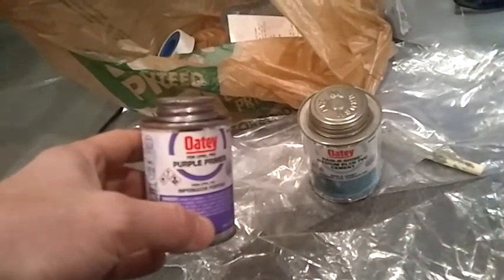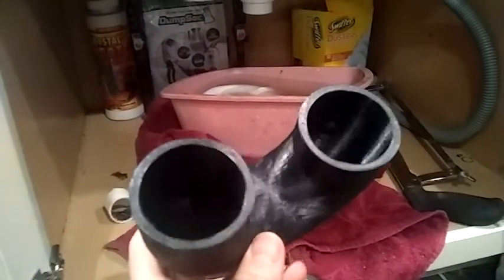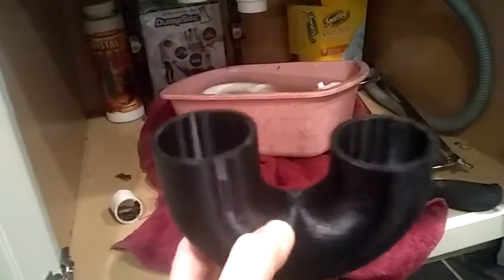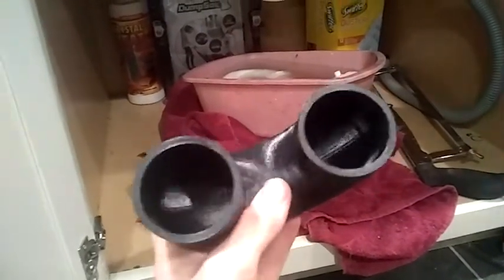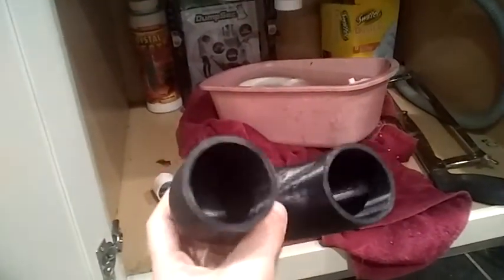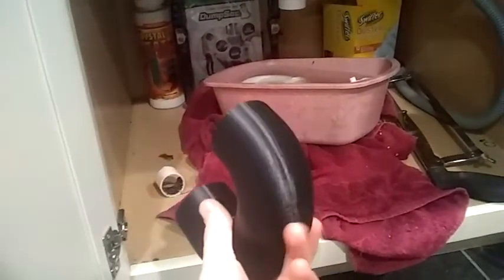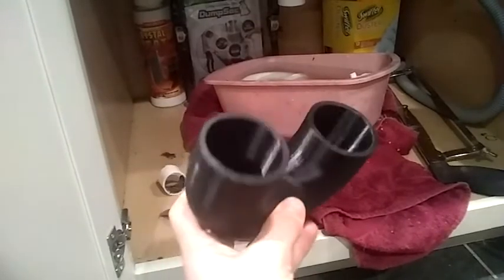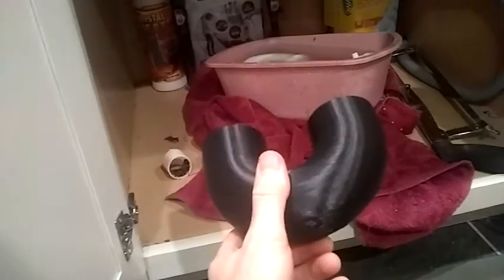Normally I use PVC glue like this, and I'll use that for any PVC pieces I have in here. But this is PLA, so I'll epoxy it to the PVC fittings. I'm going to coat the interior with epoxy too, just to make it last longer. I think the PLA might degrade after a while with the water and bacteria, so I'm going to coat it.